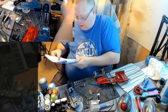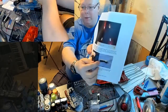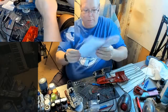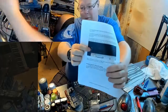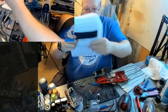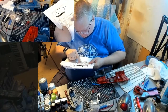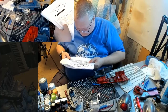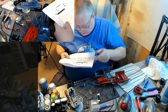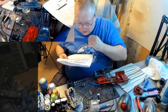So it shows me how to make those, shows me how to make the engine lights here, and in the end, they want the engine light to look like that. But also, they show them with the fiber optic lights right there for the auxiliary engines. So let's see. Flickering engine output, connect the string of LEDs for both the main and auxiliary engines here to get the flickering engine effect. And they are run in series. So there is only one engine output.